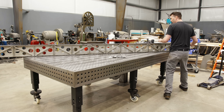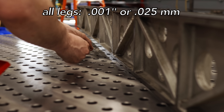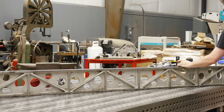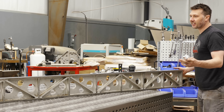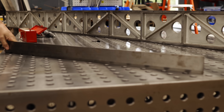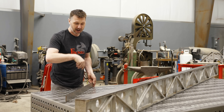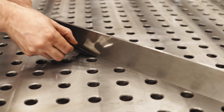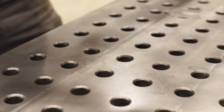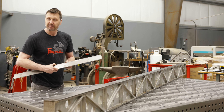Now let's see how flat we can actually get it. Three thousandths won't go underneath. There are a couple places I can kind of get the one-thousandths to go — but really, how much flatter do you need? This is almost too flat, and it's on four legs. The straight edge doesn't rotate on a point — you know something's flat when that happens. This table is flat. For the aerospace requirements, two thousandths of an inch over a two-foot straight edge. We're doing two thousandths of an inch over nine feet. That is insane — this is more than any welder needs. This table is by far the flattest welding table I have measured out of all of them.